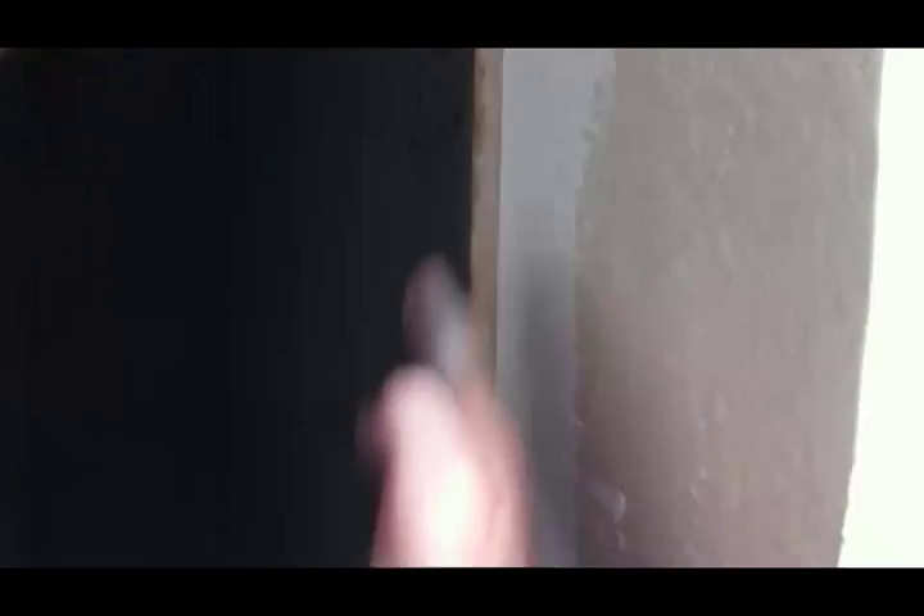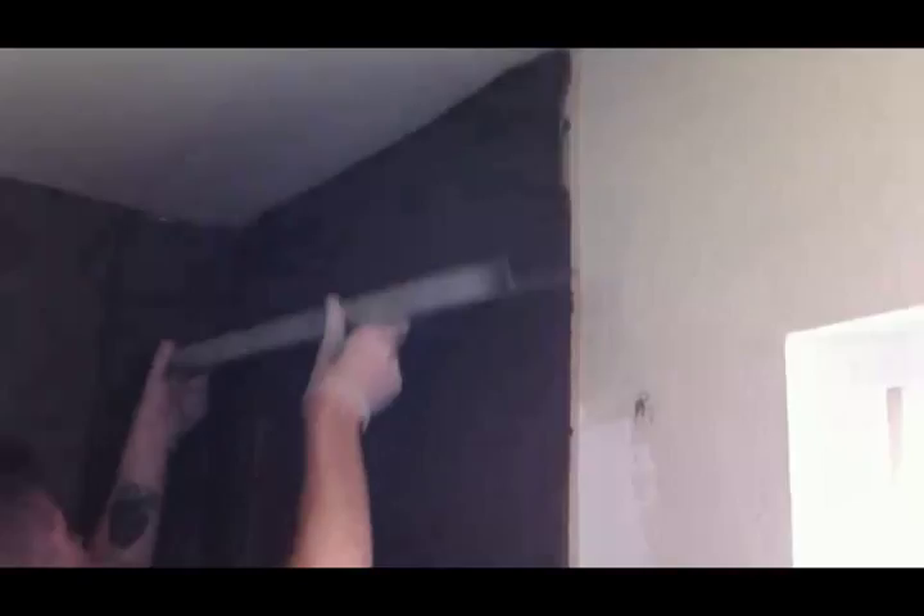It goes all the way up the wall — this makes your wall flat and smooth for easy tile, compared to backer board or wonder board. You're just marking where it's low and it just goes up the wall so easy. It's a muddy job but it's the way to go. It comes out a little more prep, but when you go to set the tile it's nice and flat.